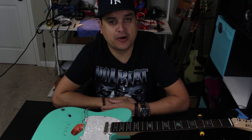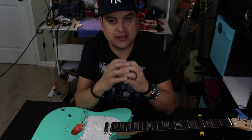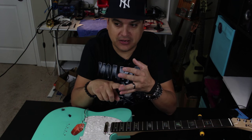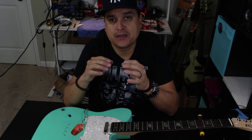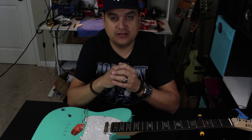Today we're going to talk about EMI or RFI — radio frequency interference or electromagnetic interference. A good example of that would be the CFL bulbs lighting my studio right now. Anything that has an electromagnetic coil in it, like a transformer, is going to give you EMI — neon lights, appliances like my TV. No matter what circuit you put that on in your house, you can end up hearing it in your guitar. The electromagnetic interference that comes off a transformer travels through the air in waves, just like sound or light, at a different frequency.